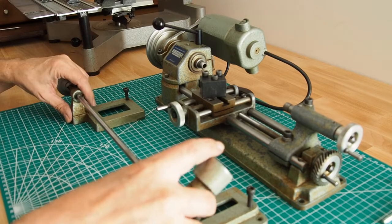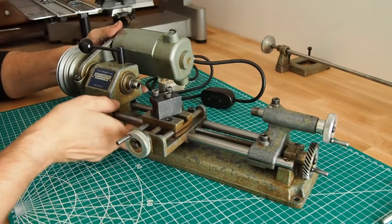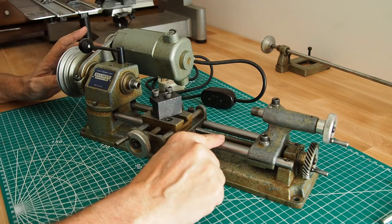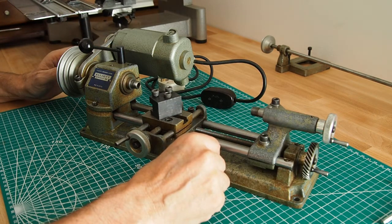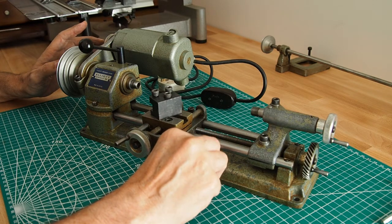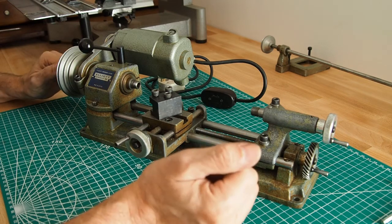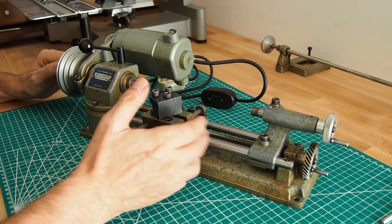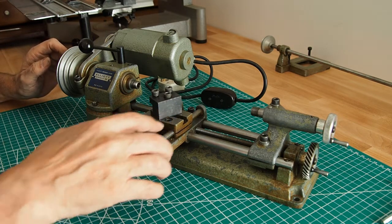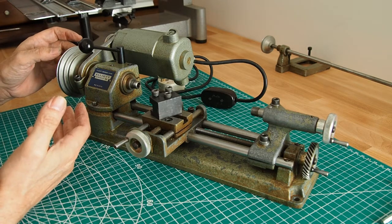I think it's highly likely I will be putting this back. What I've learned is that before you start the disassembly process, if your lathe is covered in grease or whatever - as this one was - it's worth giving it a bit of a clean down and trying to get all the junk off the ways and everything, as it does make the disassembly a lot easier. I would also put the cross slide in the middle of the lathe, and likewise the tool post in the middle position, because that would probably help a bit later.